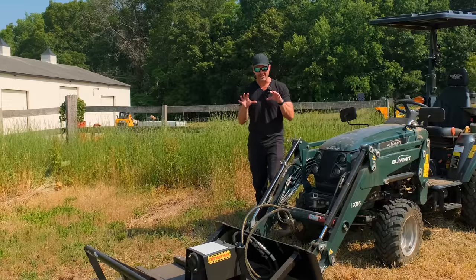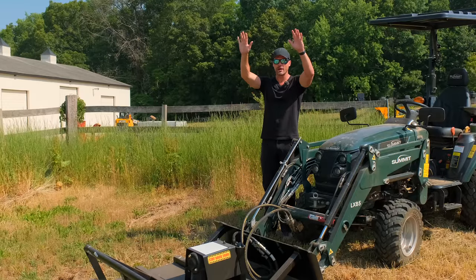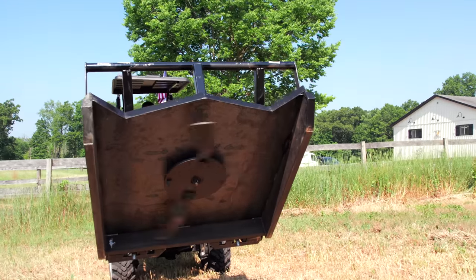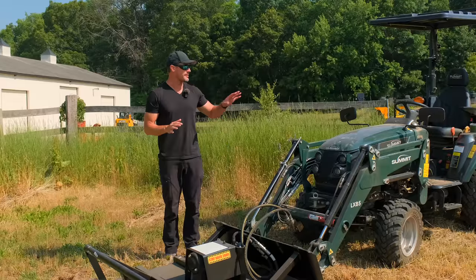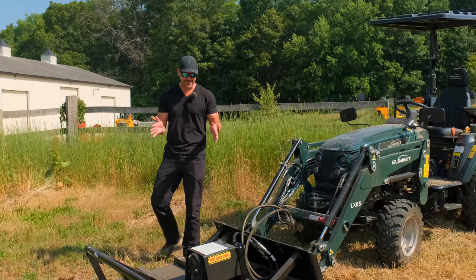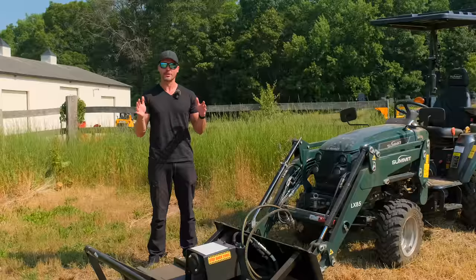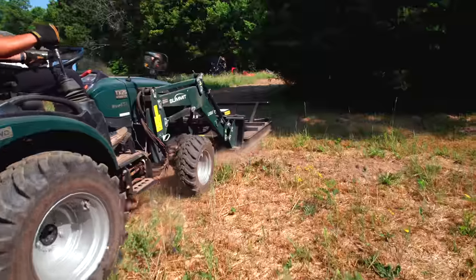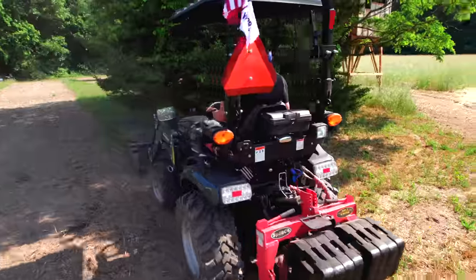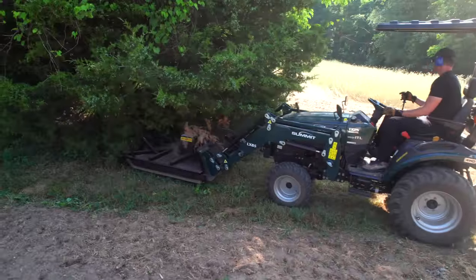The other big thing to think about with a loader mounted brush hog is all the different angles. If you raise this thing way up you have the potential to put that cutting surface at your hood, your face, or anywhere else. You really have to be aware as an operator on how to use one of these safely, because you're within 200 feet — you're close range. The blade tip speed on these things can be 10,000 to 20,000 feet per minute, sending projectiles out like bullets if they whack something. Always reference your manuals and read your safety manual on the tractor and any attachment.